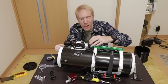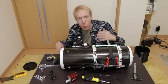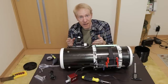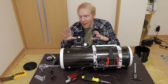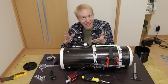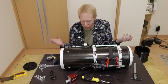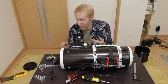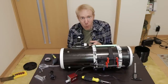I did two layers of electrical tape. When I tried adding a third layer it started having issues racking in and out, so I removed it. With two layers I found the perfect thickness to really isolate the draw tube from the focuser assembly, and when I shine a light on it there is no more light leakage. I don't think I've seen anyone doing that before and it seems to work well — it costs only a little bit of tape, so you might want to try it.